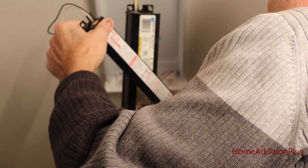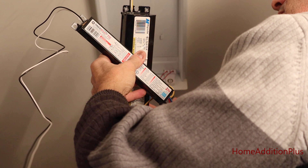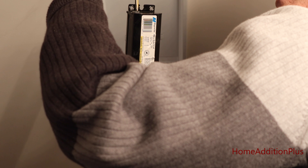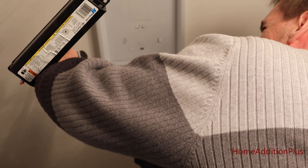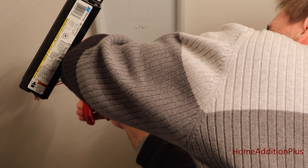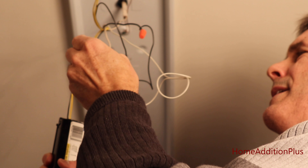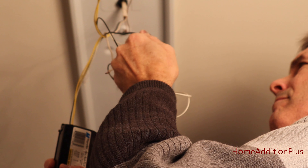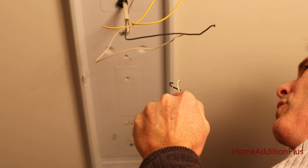You'll notice the color code of the wires are the same: blue and red on this side, yellow, black and white. What I'm going to do over here is cut these, strip the wires, and splice on this side. Here I'll just take off the wire caps and put on the new wires in place of the ones associated with this old failed ballast. I'm going ahead and cutting the blue and red wires out on this side, removing the wire nuts associated with the white and black, and also cutting away the yellow wires. We've now removed the old ballast.